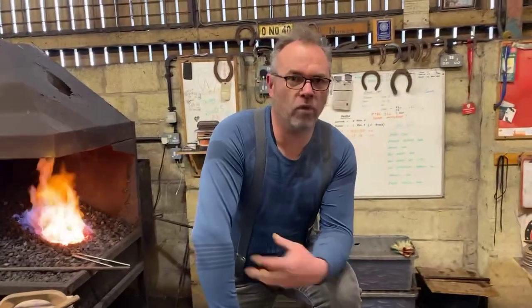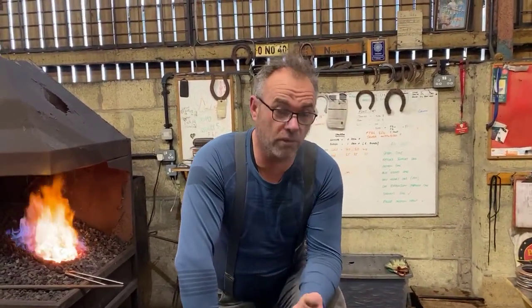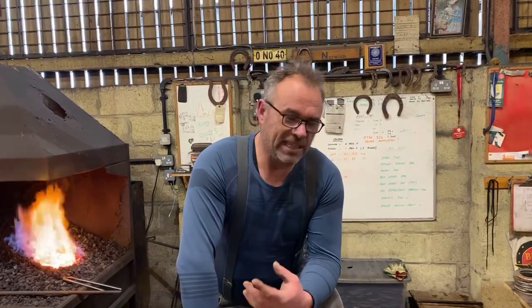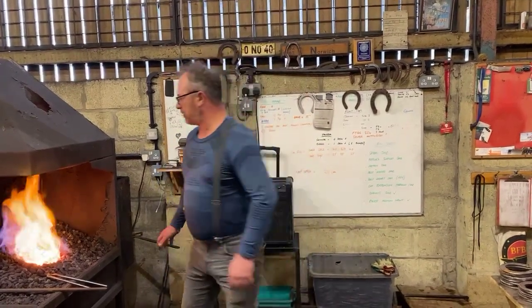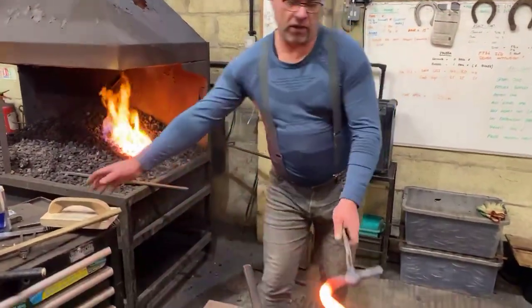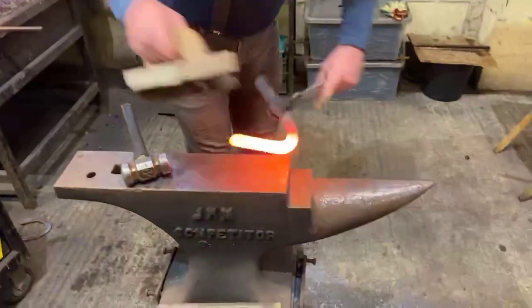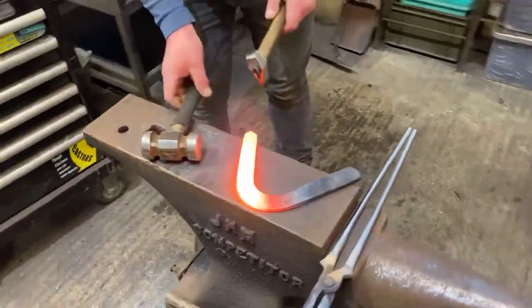Again, depending what section you make the shoe out of, if you're going to mess around with inch 5/16 or even 3/4 5/16, remember technically you're going to need a wider fuller. There are ways of leaning your hand out to make the fuller a little bit wider, but obviously the wider you can go with your fuller, the better. And again, there are other variants of nails out there which fit 5/16 a lot better, like MXs, etc.